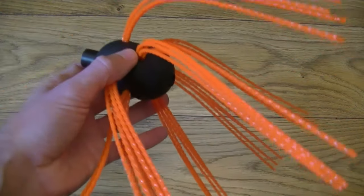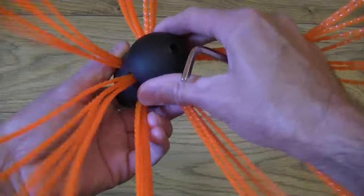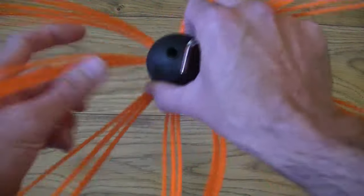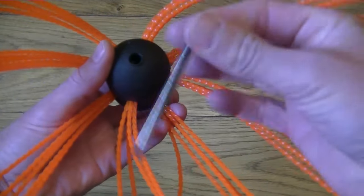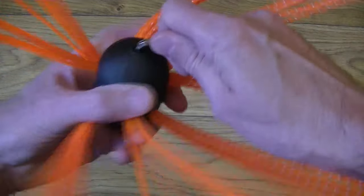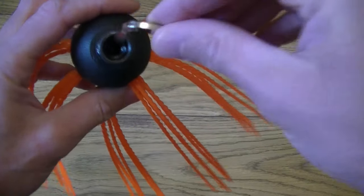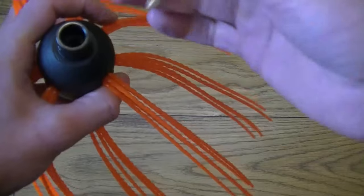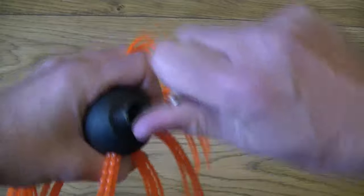Taking a quick look at the brush head, it came supplied with all the bristles through a plastic head. When I felt it, it was ever so slightly loose, so you want to move these around, make sure they're central and located properly. Then using the allen key supplied, go down inside and there's a little allen key slot — just tighten that up and make sure it's nice and secure. The other end has exactly the same, so place your allen key inside there.